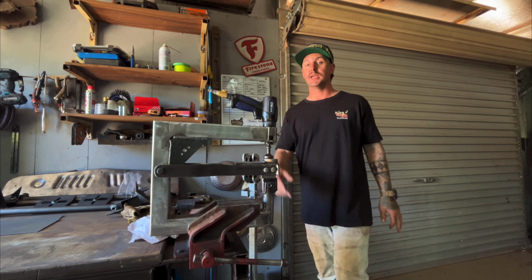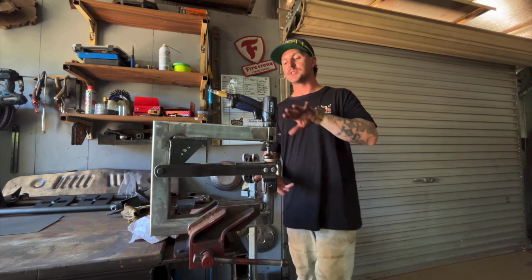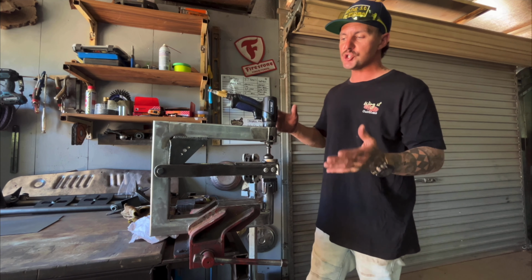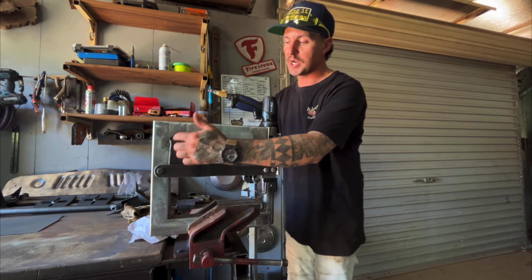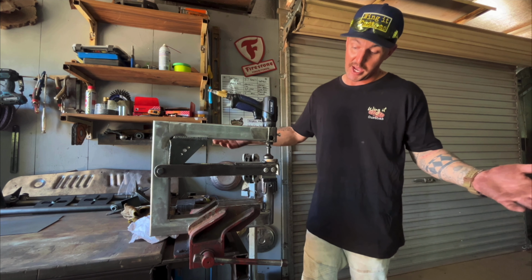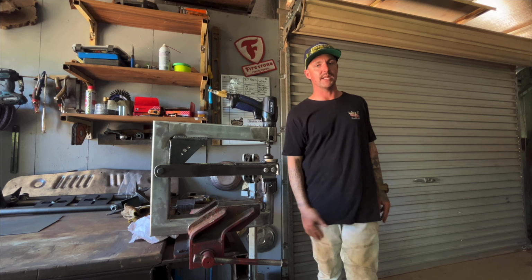If you are wondering, overall, this is about 14 inches tall. So it's not very big. It is square as well, 14 inches tall, 14 inches wide-ish, about that. 50 by 50 tube, 3 mil thick, couple of bracings here for the corner, top corner section. That's about it. So yeah, let's get into shaping up these top and bottom dies. Then we're gonna run some steel through it and see how it turns out.